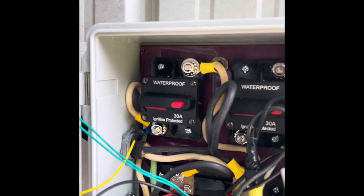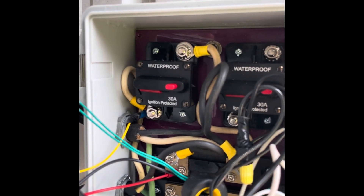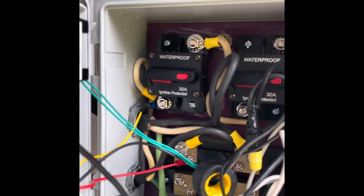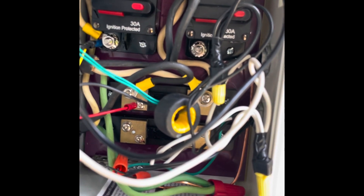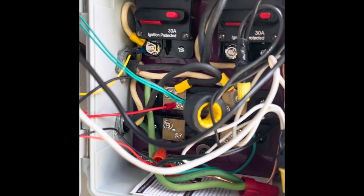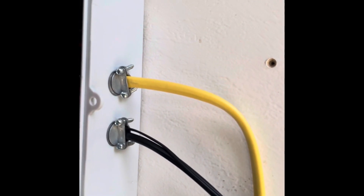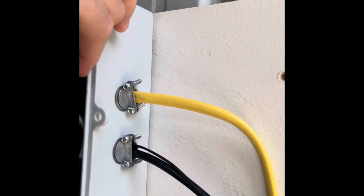Number 10 wire is in series with that 30 amp breaker, so it's protected — number 10 is rated for 30 amps, so that should be good. The little DC meter requires these shunts that you have to connect your negative wire through, and it reads voltage off that to calculate the amps. I like having the amp reading on the panels just to make sure everything's good.